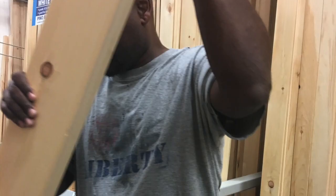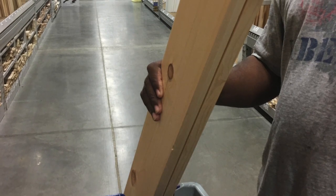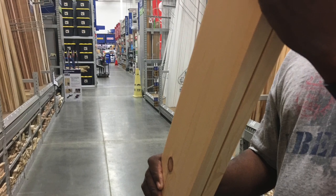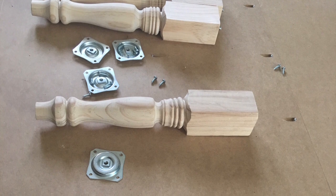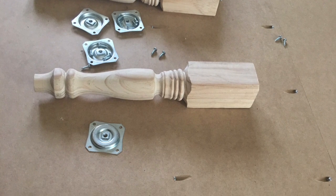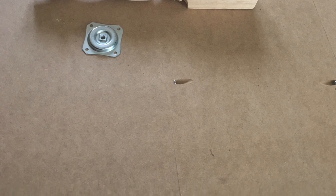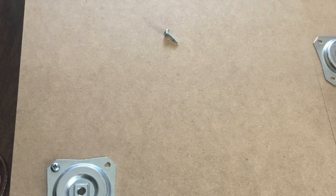We headed out to Lowe's and purchased three composite pressed composite shelving boards, and also one or two 1x6 studs to go around the sides. I decided to go with the three pieces of composite shelving as opposed to just a piece of plywood because the three pieces together came out to exactly the size I wanted without having to be cut or altered in any way, and it was cheaper than plywood. My husband used his Kreg jig to connect the three pieces together and make sure they were nice and sturdy and would not flex. We also purchased the legs and all the other hardware from Lowe's.